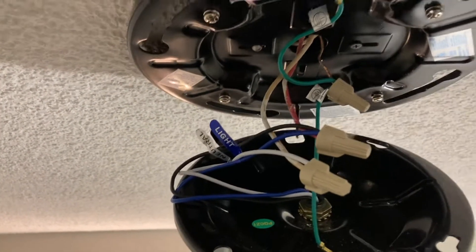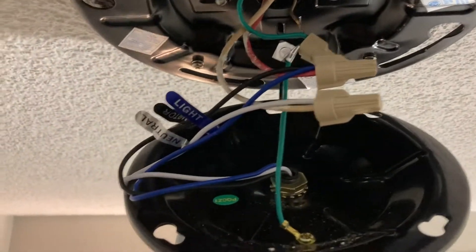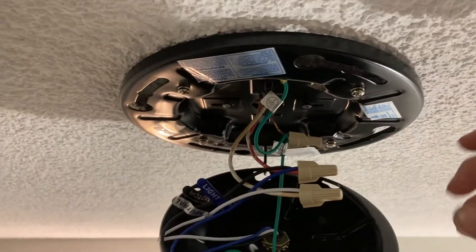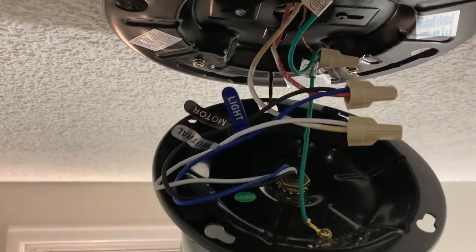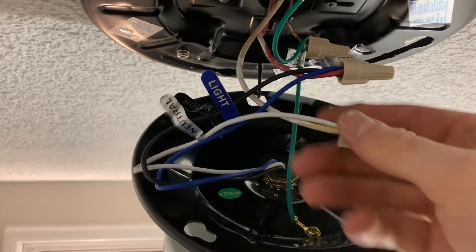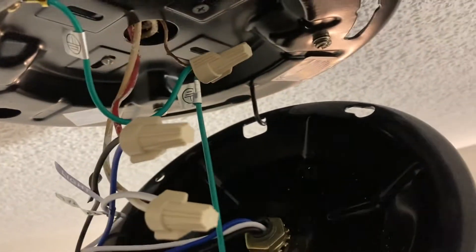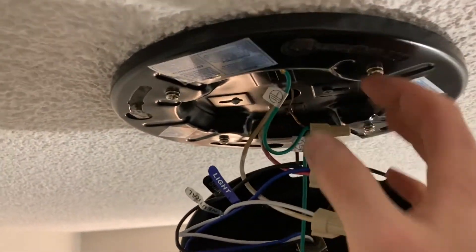Just in case you're not a fan of wiring — it's not really that bad. We've got the ground wire coming out here, and we attach the ground from the base and the ground from the fixture up into the ground wire together. You twist those wires together and then wire-nut them. The blue wire is for the light and the black one is for the motor, which just turns the fan. Because we're only running one light switch there's only one hot wire, so you run both the blue and black to that hot wire, and neutrals always go to neutral — so white to white. The cool thing is you can mount the motor body on that little hook while you're wiring it, then loosen the screws, slide into the holes, line it up, tighten it down, and the motor is mounted.